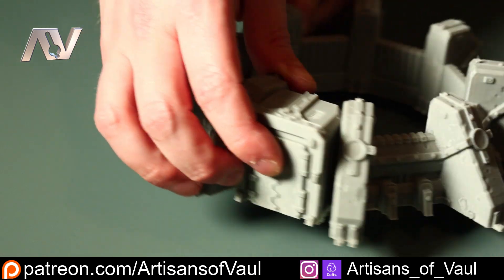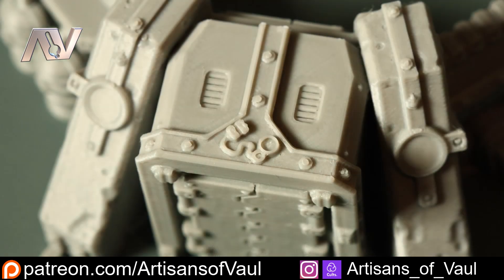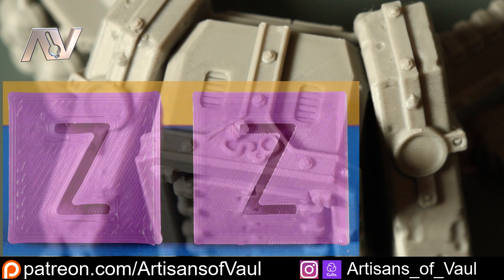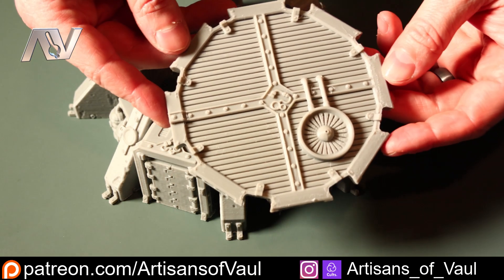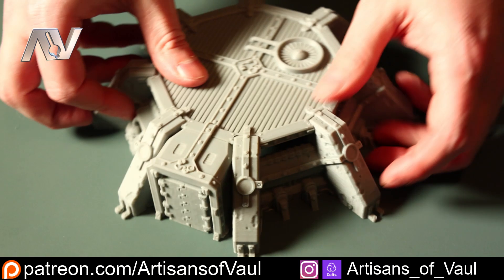I also spotted what was quite an interesting result. This is a flat surface that's parallel to the build plate, and that's normally a problem area for 3D printing with filament — you normally solve that by ironing. And I did iron this, but you don't normally get results as good as this. You generally get these remnants, which you can see on the example on the right-hand side where this has been ironed, but it doesn't look as perfect as this does. And that's even on a bigger scale — this filament irons really, really well. Surprisingly well. It's an interesting characteristic for filament to have, because sometimes you have projects which have a lot of surfaces that are parallel to the build plate — for example, the roof, or in other projects your flooring. So this is really desirable.